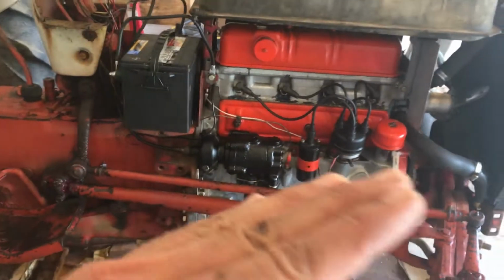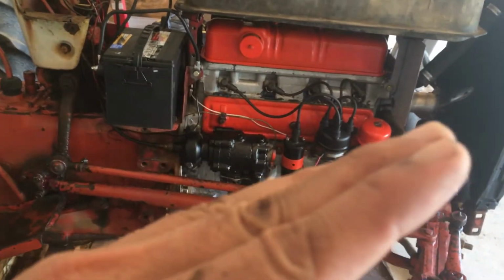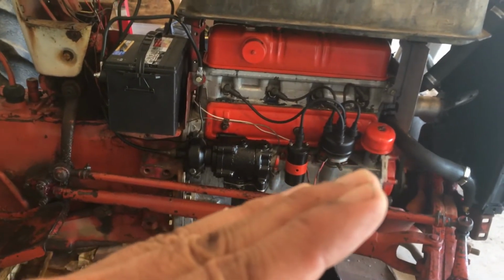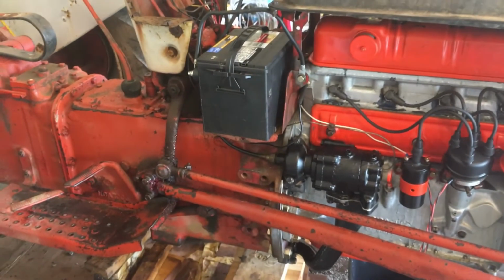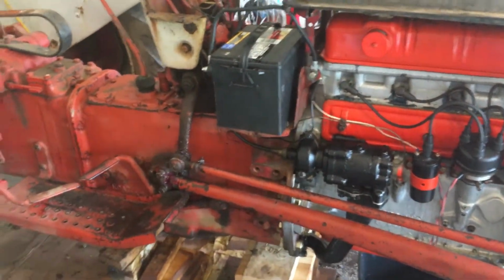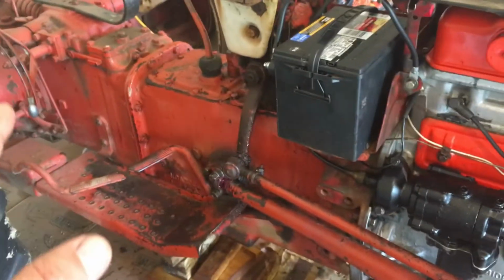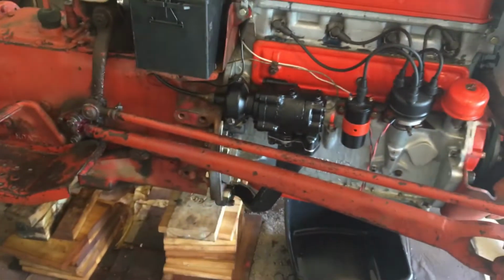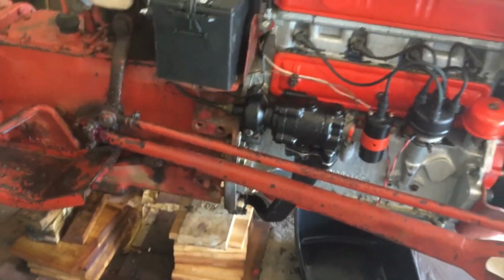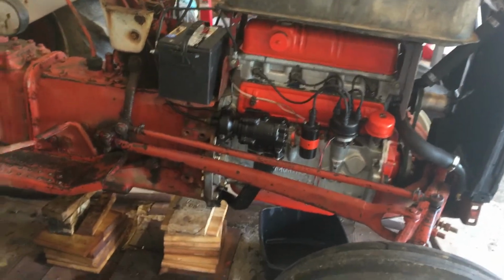bring your tractor front end a little higher so it's on an incline. Probably that will push more oil to the back of the tractor, into the sump or oil reservoirs, so it won't leak from the front of the tube or from the transmission. That may be my suggestion, but I haven't tried it, so I'm not sure it's going to work for you.